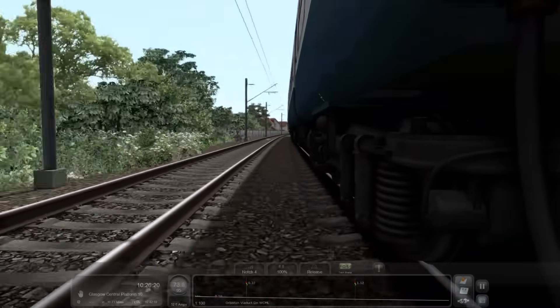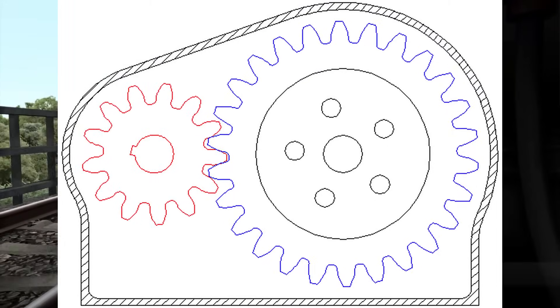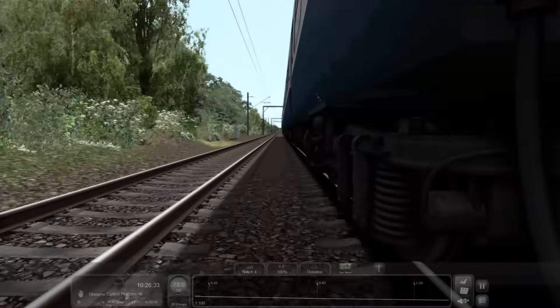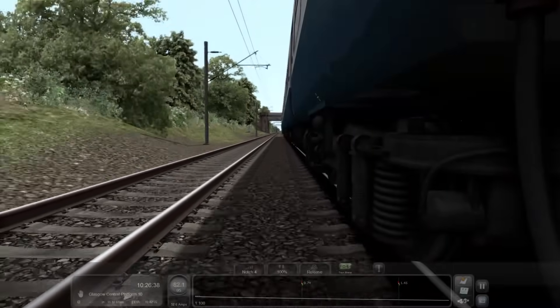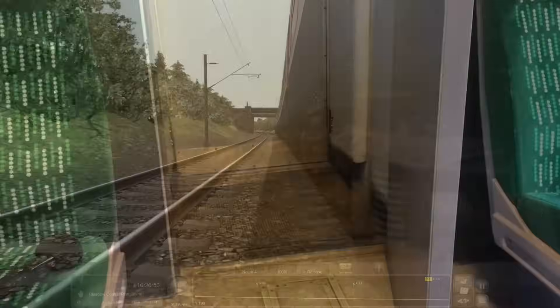Due to space constraints and risks of uneven motion, the gears in many of the suspended drive gearboxes were straight cut. This is where each tooth in each gear is horizontally aligned, and each tooth of one gear can easily mesh with the tooth of the next gear. A sound is made whenever each tooth hits the next tooth, and this creates the sound of ascending pitch as the gears rotated to higher speed. As the teeth wear down, the space between the teeth increases, leading to a greater area of resonance, which can drastically increase the volume of the gears.